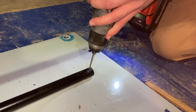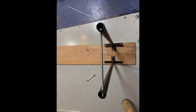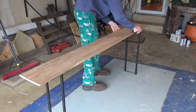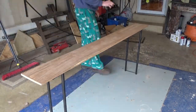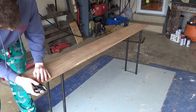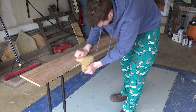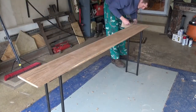It was definitely a tight fit trying to get the threaded rod to be exactly the right length and thread the nut onto it inside the conduit like this, but I definitely liked the idea of not being able to see either end of the threaded rod or the nuts. Now I'll just spray paint those threaded rods to match and touch up any other paint on the legs, then move on to the finish sanding on the top. At this point the board had already been sanded to 120 grit so there really wasn't too much more to do. I took my plane down the edges to give it a little bit of a chamfer, but for the most part I was just removing small scratches. I had to sit there for about 30 minutes doing this, but luckily there's fast forward and the enjoyment of my llama pajama pants.